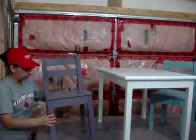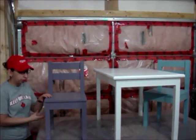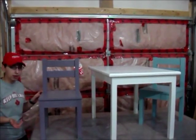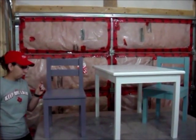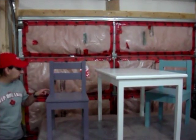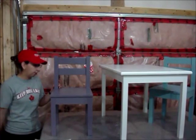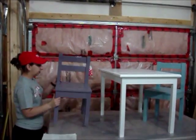For putting the tops on, I made the base a little bit wider than the plans, but I thought it would save me a couple extra pieces of wood. I had a nail gun and used a staple gun — I think it was inch and a half nails in length by a quarter inch staples that my gun would take. I basically stapled two per piece with a little bit of gorilla glue to keep it nice and strong, since kids will probably be toppling or climbing on it.